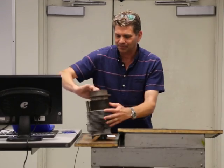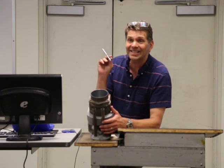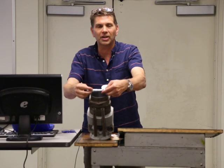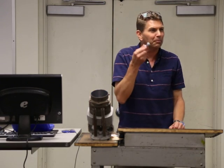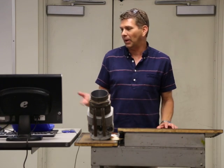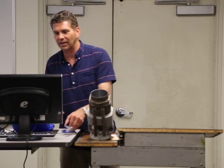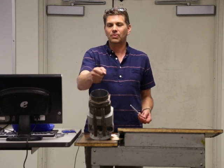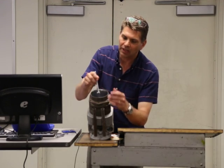In a production shop I did not use T-gauges — I used an inside micrometer, which has carbide tips on each end. You put it in, unscrew it, and it's calibrated to read the diameter. I'd get a precise measurement, then set up a bore gauge. Once a bore gauge is set up, there's no reason you can't do a set of six cylinders in two to three minutes — just drop it, get four measurements, done.